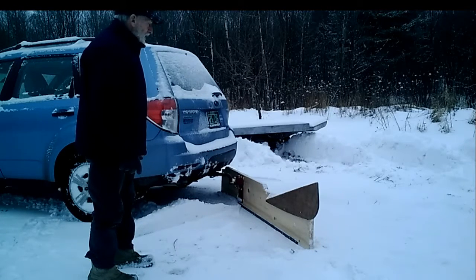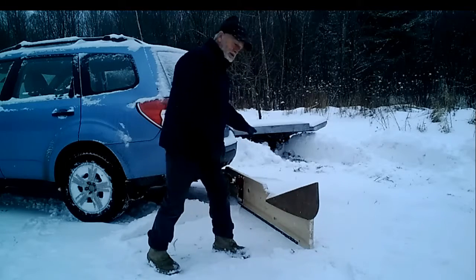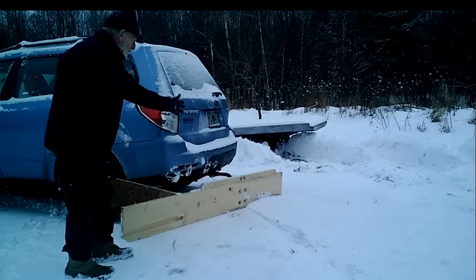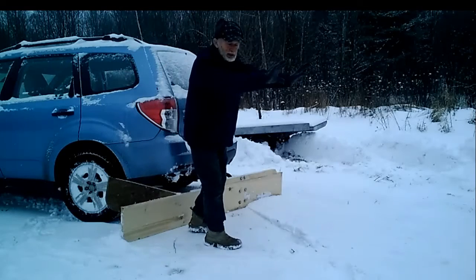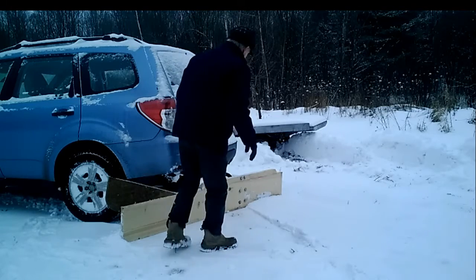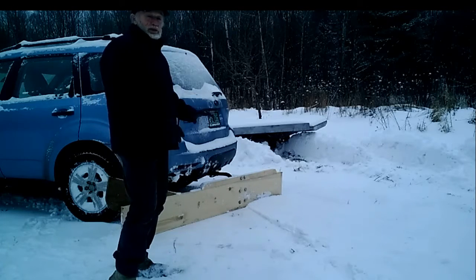There are times when you need to back up, of course. I've got a nice circular driveway, but I get to the road and I have to back up. Because this is free to turn, when you start to back up and because of the unbalance, it gets pushed the other direction. I made it a little bit square — not quite straight across, but a little square — so that more of the snow is just pushed back rather than diverted to the side, as it is when you're going forward. When going longer distances forward, you can't just let it pile up on the plow, you've got to push it to the side. So in reverse, like turning around at the end of the driveway just before I get onto the road, I can put it in reverse and push the snow to the side and turn around that way.